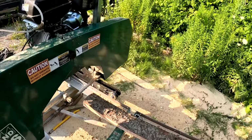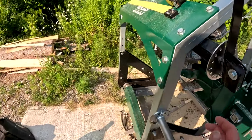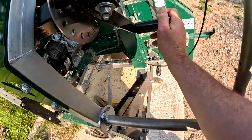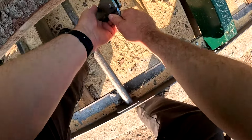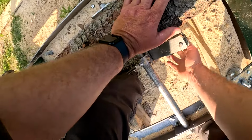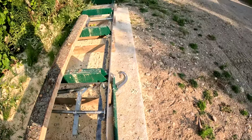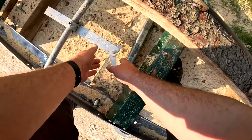Okay. Put that down, make sure the blade clears. So we got to measure from underneath an inch and a half from the bottom of the wood to the top of the bottom of the blade, sorry. Yeah, we should be good there. All right, let's try to clamp her on here too. And this has got to go right on the bottom. That one I won't be able to clamp because I put that other piece on it. That kind of screws it up a bit.